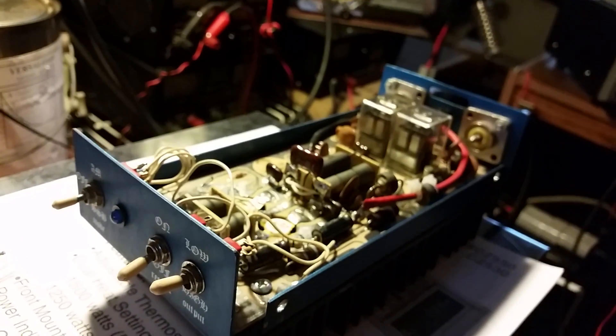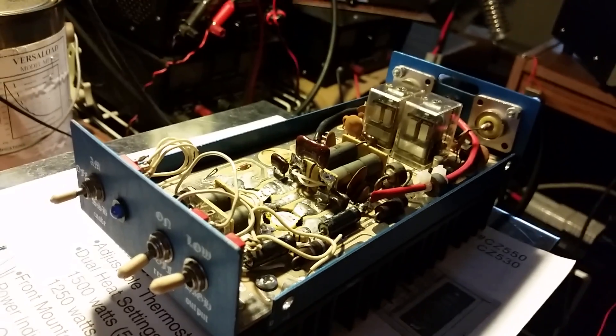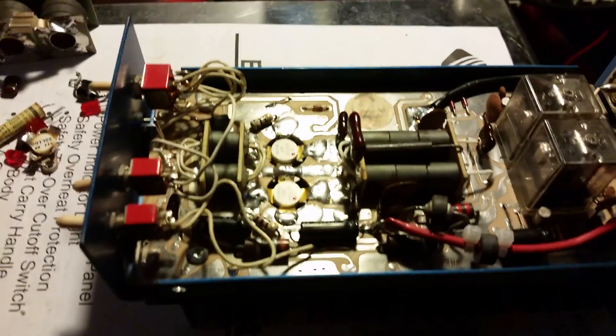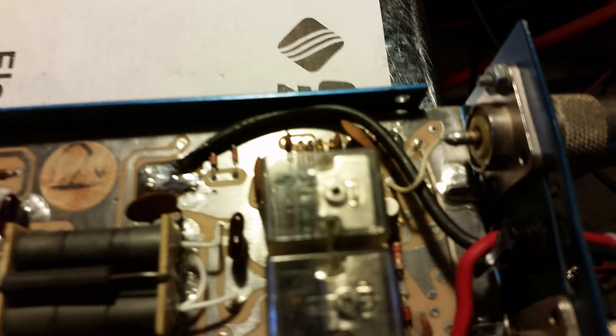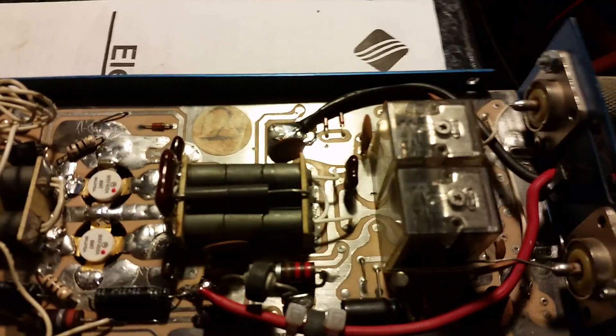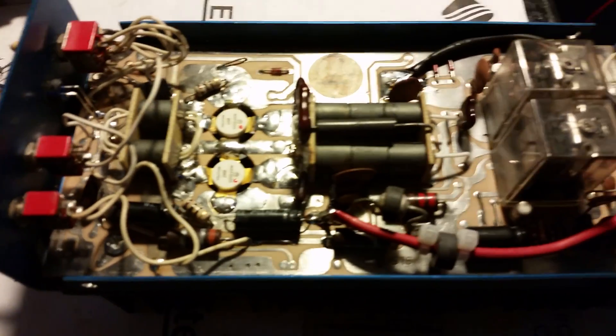I'm just going to show you what we're putting into the amp — about 21 watts. That is called an invert circuit. The only other amps I've seen that in are a Texas Star TX800 series and that Cobra 400 I just got done doing. I have my own invert circuit that I use, but I like to look at other variations and document them. This one is a little more complex than the one I use, so I don't think I'll be adapting to it.